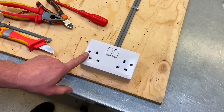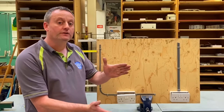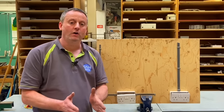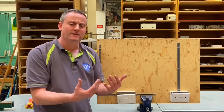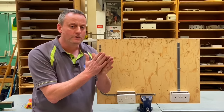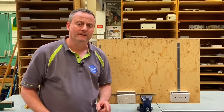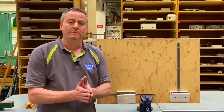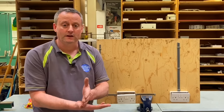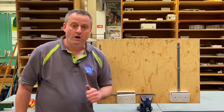That can go down and be fixed using the appropriate 3.5mm machine screws. To recap the crucial points: make sure conductors are long enough in the appropriate direction — 50 to 70 mil longer than the box. Practice the doubling-over of each termination to work out the depth. Terminate the conductors, dress them into the back of the box first, push back into position, lever forward, and recheck-tighten as they may have shifted. Finish by returning the machine screws to the front of the socket. As I say to all my learners: every single termination you carry out should be made to last 50 years. If the screwdriver is wrong, it isn't tight enough, the cable is too short, or there's too much exposed conductor — ask yourself whether that termination will last 50 years. If the answer is no, go back and sort it out.